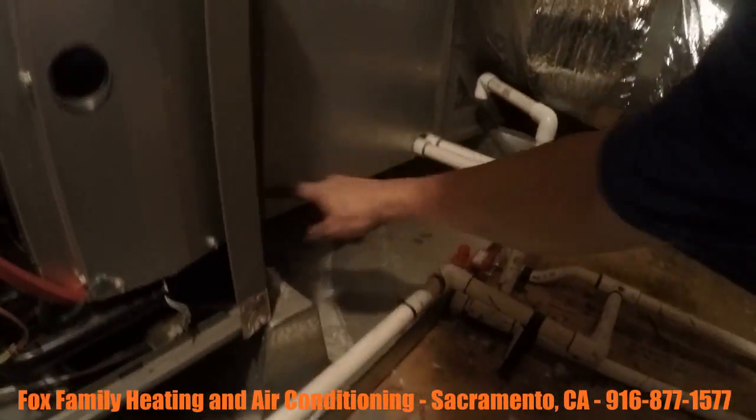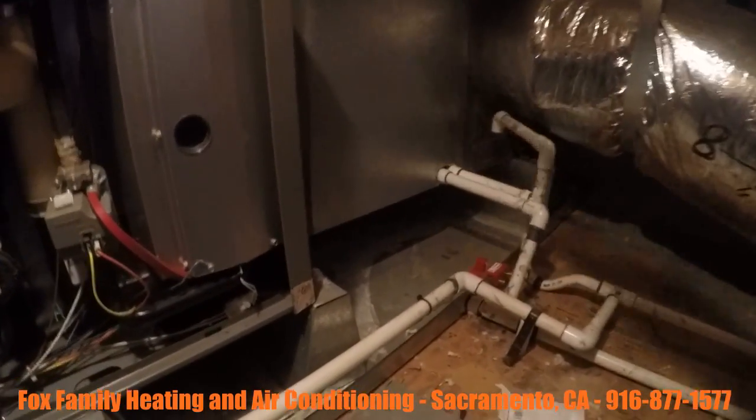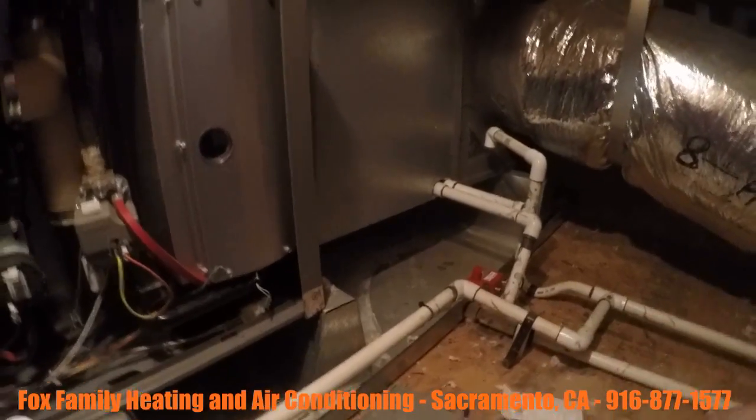This doesn't come from the manufacturer — it's something that you're adding on out in the field — but I just feel so passionately about it, especially as a homeowner. I came up into my attic one time and I saw my secondary drain pan full of water, literally filled to the rim, like the water was coming down onto my sheetrock next. I don't know what made it so that I happened to catch it and look up in my attic, but I'm really glad I did. Now I have a switch on there, I blew my condensate line out, and I don't have any more issues with my condensate pan. What was happening was my drain pan that sits in here was rusted out — whatever was coming through was just leaking right down into the pan and then not going out the secondary.